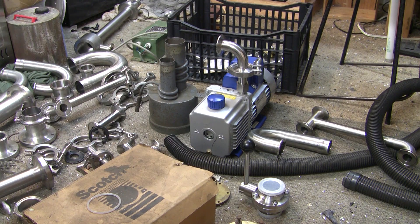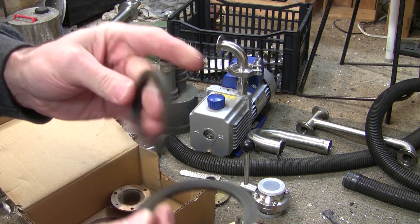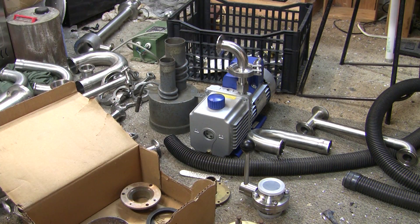Let's get to sticking this diffusion pump back together and see how we go. The seals that were originally with the diffusion pump are Buna-N rubber, with nice little brass flanges. I'm not expecting to get to ultra-high vacuum, but I should be able to get to a low enough vacuum - I want to be able to make an x-ray tube. Hopefully this will get to a low enough vacuum for that, and some other vacuum experiments. I've started making Geissler tubes and other bits and pieces, experimenting with vacuum and high voltage.